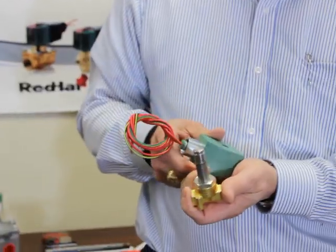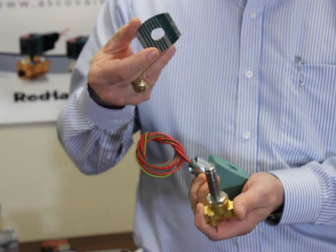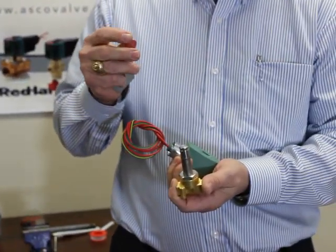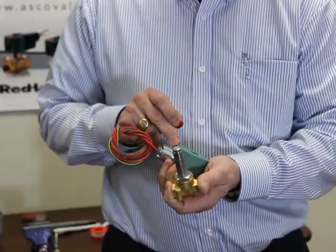It's called Red Hat 2. The name plate is what holds it on. If you lose that name plate, you've got a problem, because the red cap that goes on the top is only decorative — all it does is sit there and look red; it will not hold the coil on the valve.